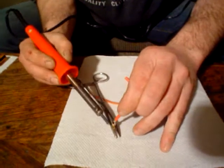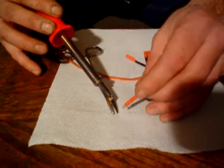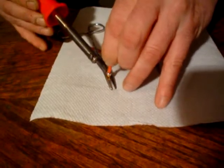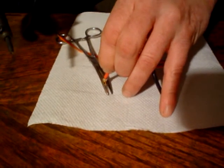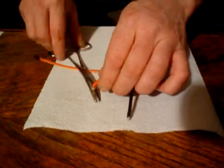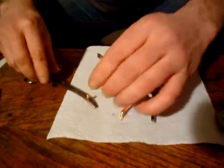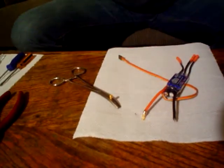These can be a bit tricky and can also get rather hot. Put some heat right onto the connector first until the solder in the connector begins to liquefy again — it takes a little bit — then stick that right inside there and hold it until it sets up. Soldering 101, no big deal. It takes a little practice; I wouldn't suggest starting out on these connectors. If you're going to learn how to solder, try a couple of pieces of wire and get used to how your iron heats the materials.